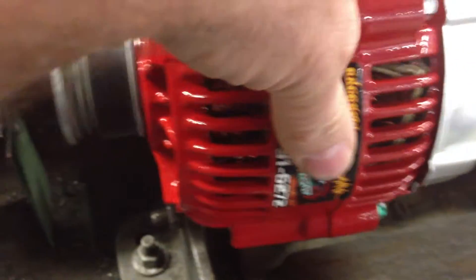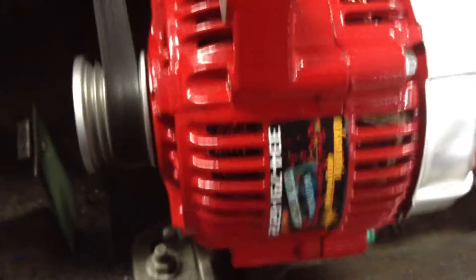This thing is hot — it's been running for a while, so this is hot rated. I'll run this thing up to about 2,000 RPM. We'll put a load on it and see what it does. Right now we're showing just over 15 amps — that's just resting, what's in the battery. There's no load on it, so we'll go ahead and load this thing up and see what we can get out of it.